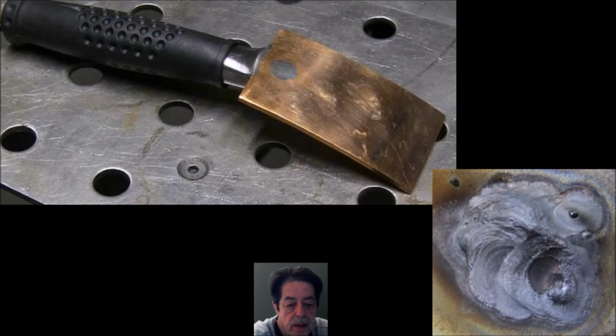So they all have their quirks. Doing a fender well like I did is a little bit tricky, and you've got to play around, but you can do it. When you grind it down, it'll come out flat like the original metal, and it looks seamless. If you just take your time and let it cool down, that's the best thing when you're tack welding.